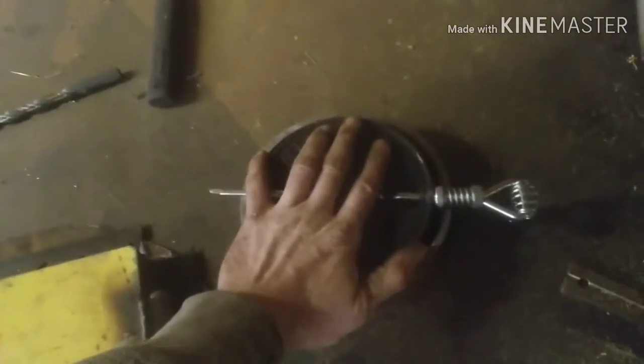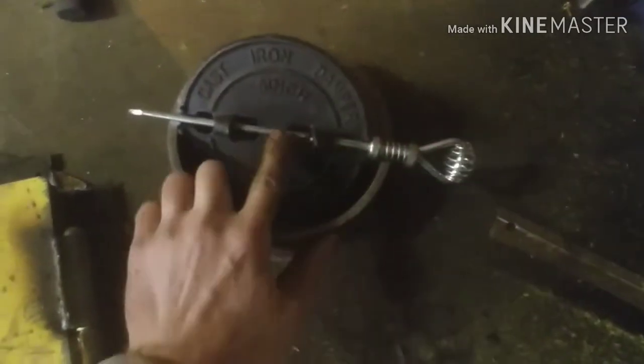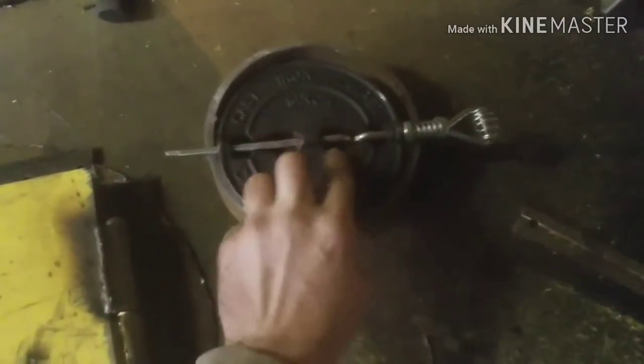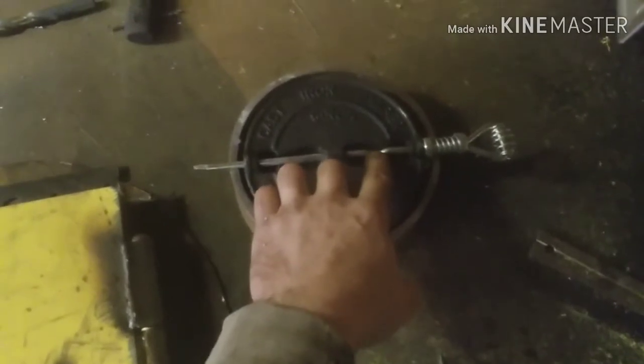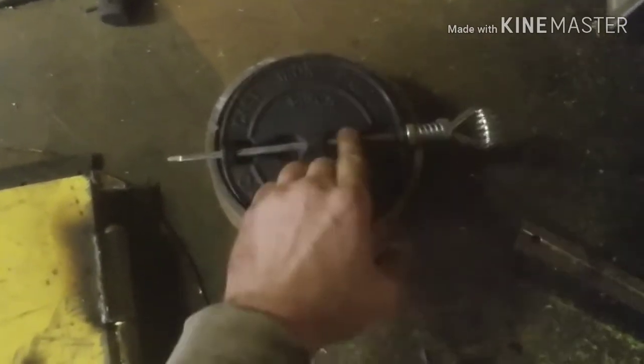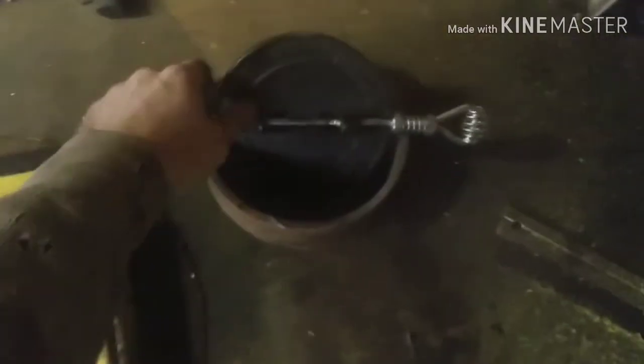Back again — I found it hiding on the welding table. Six inch cast iron damper, they're like four bucks from Menards. I normally take washers and place one on either side and one in the center, then weld the washers to the steel bar since you can't weld to the cast iron. Those washers prevent this little nub from rounding out as the exhaust gases heat the metal up to about 500 to 800 degrees. But with the three washers welded to it, they don't round out, and that basically locks it up as one solid piece because the washers put the turning force to the cast iron damper.